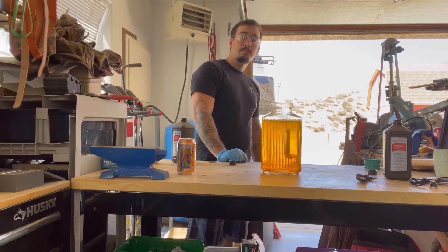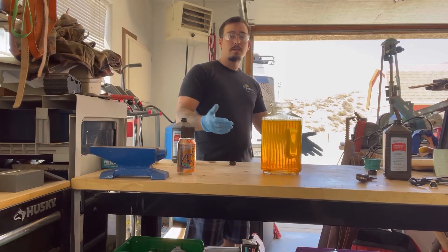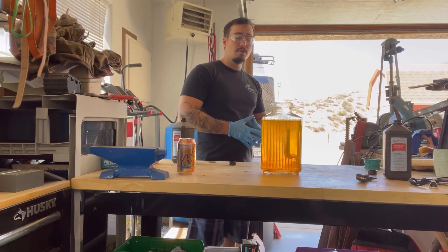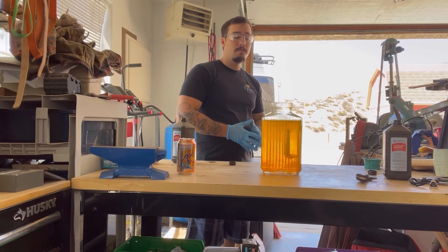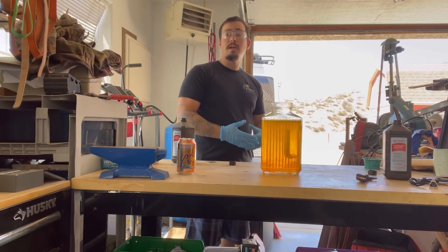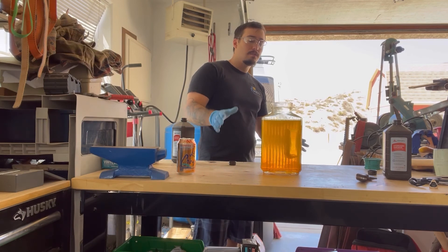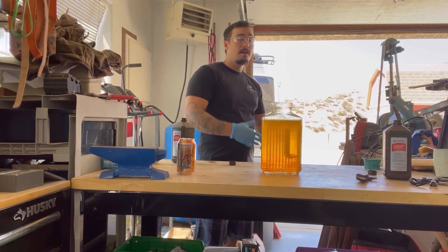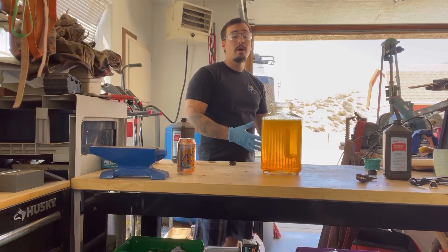Because I'm in a workshop here, this is uncovered. It's important to know that ferric chloride — which is essentially what this is at this point — as it's in the air, can actually begin to rust things in your workshop. Now that we've taken the time to put everything in here, we want to take the mixture back outside and let it continue to gas off. And if I do store it in the workshop, it's important to store it covered in order to protect my power tools, which we don't want damaged.